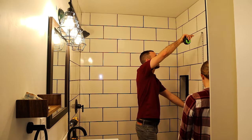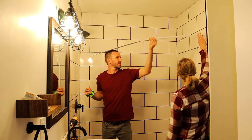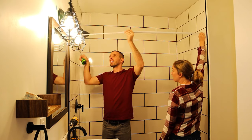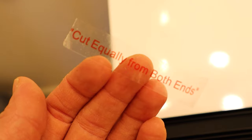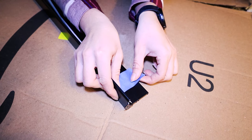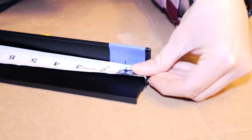The first step is to measure the width of your shower at the top and bottom and purchase a door that fits. Write these measurements down and follow the instructions on how much you should cut off. It is also important to note that the bottom rail will need to be cut equally from both ends because the sliding door divider should be centered at the base later on. I'm using painter's tape here because it's easy to write my cut line on, and I'll be removing just over an inch off of each side from my shower base rail.